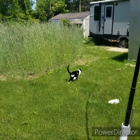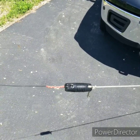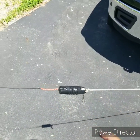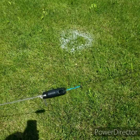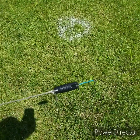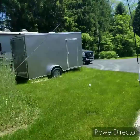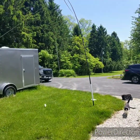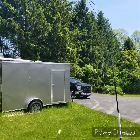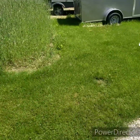Why are cats always attracted to ham radio? This is the end of the hot leg of the doublet — hot means it goes to the center conductor of the radio. I've got it marked with red shrink insulation, just a dog bone antenna insulator there. The other leg of the antenna is marked with green shrink insulation from Harbor Freight. It helps me if I ever need to set this up as a sloper — I'd know which end is hot and put that up high, and the counterpoise end low.